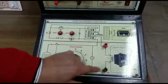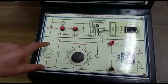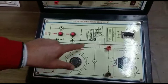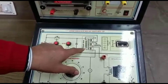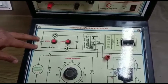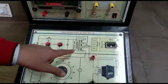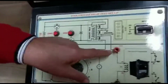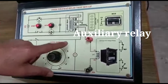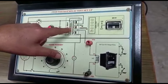This is activated by the line voltage that we can vary from the variac. The auxiliary relay is for start and stop and is supplied with 24 volt DC with the start button and stop button. The relay contacts are connected through this, as well as contacts of the timers for the start and stop operation.